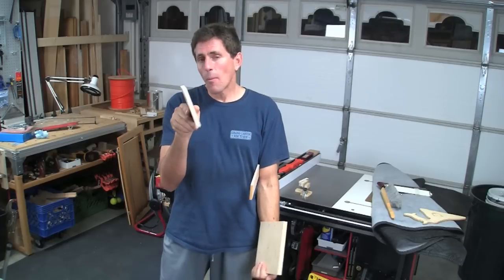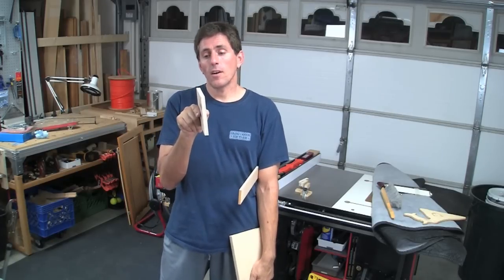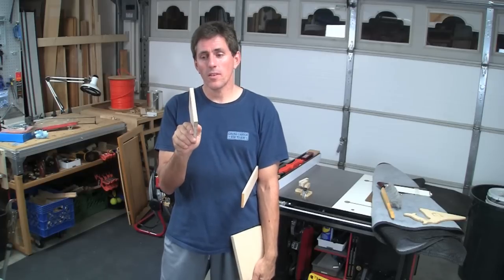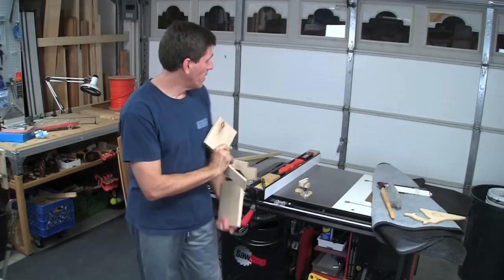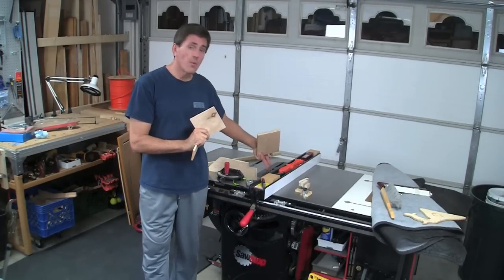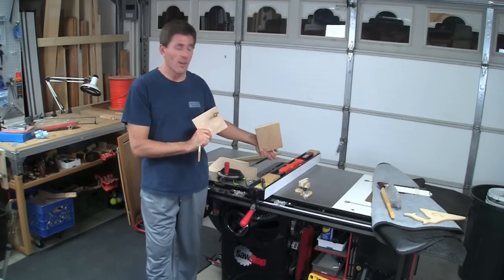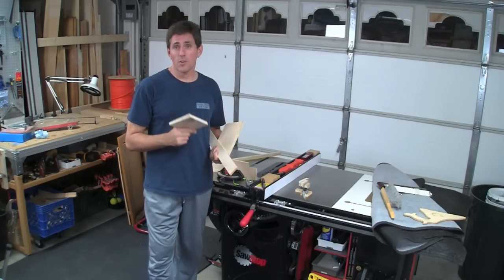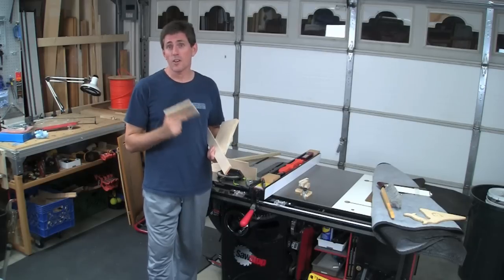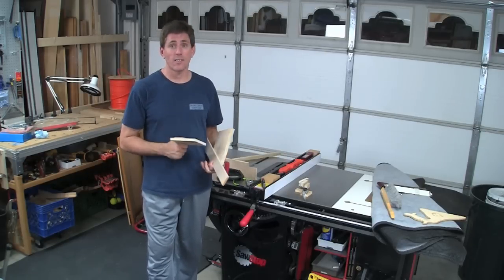This nominal half inch piece — which of course means it's nowhere near a half inch — is going to take two passes. The beauty of this is I don't have to take a caliper measurement and fiddle with all the chippers and outside blades and shims. A lot of people mess with the shims until they get just good enough and then make the pass. With this, you're going to see how accurate this tool is.